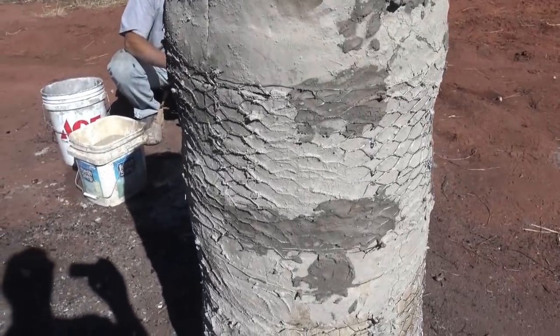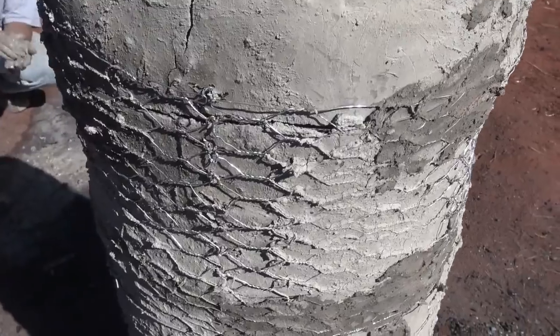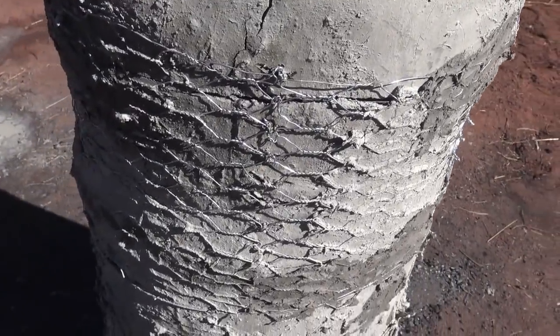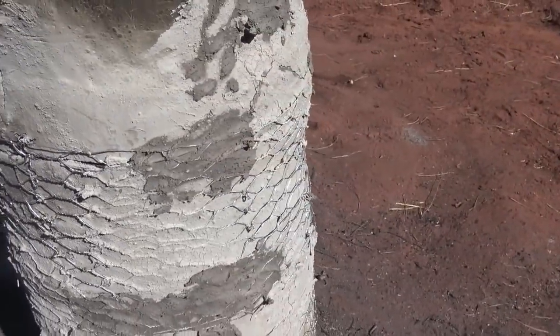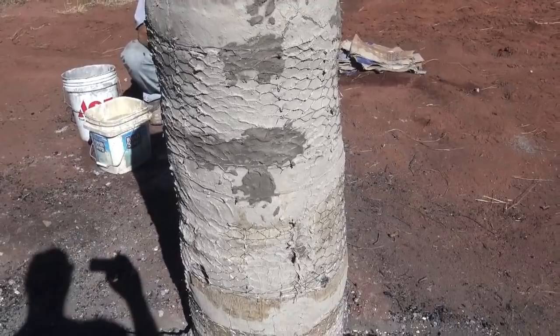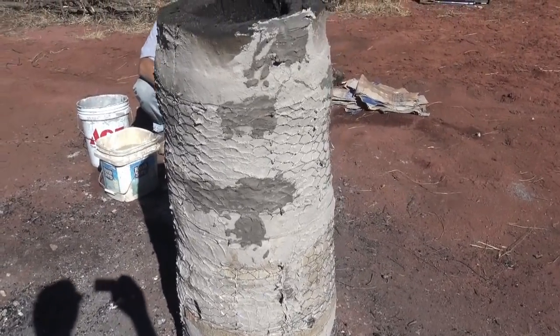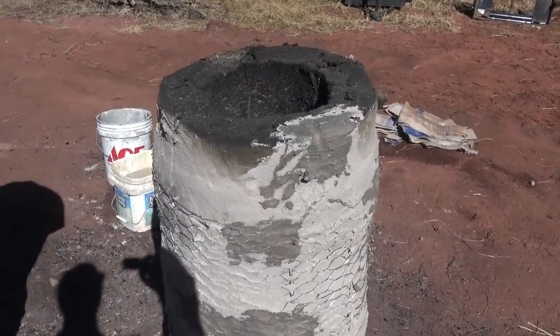So as we get down to the wire, Jake has gone to the chicken wire here. Literally down to the wire. Exactly. And that's just there to help ensure that none of the cracks cause this thing to fail. The cracks are no big deal because this is all sacrificial anyways. And about this time tomorrow, it's going to be a heap on the ground as we pull the bloom out.